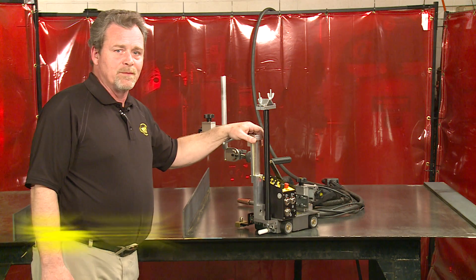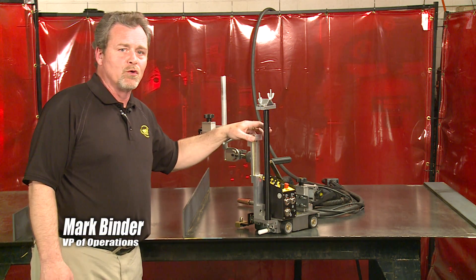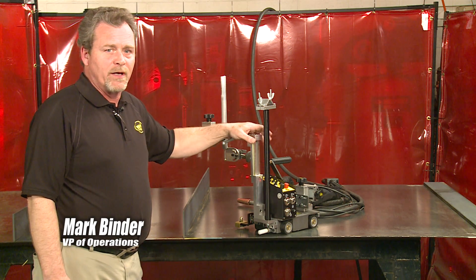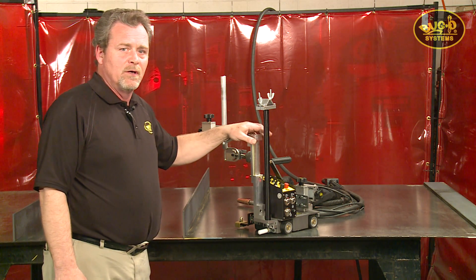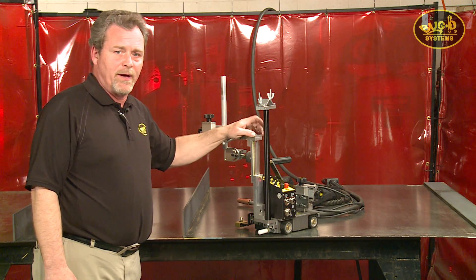This is the K-BUG 2000. The K-BUG 2000 is a compact, lightweight, portable, dual-sided fillet welder. It will handle straight-barreled or gooseneck guns, and the controls control the weld contact on and off as well as the travel. The digital control will give you precise stitch welding or continuous weld patterns.